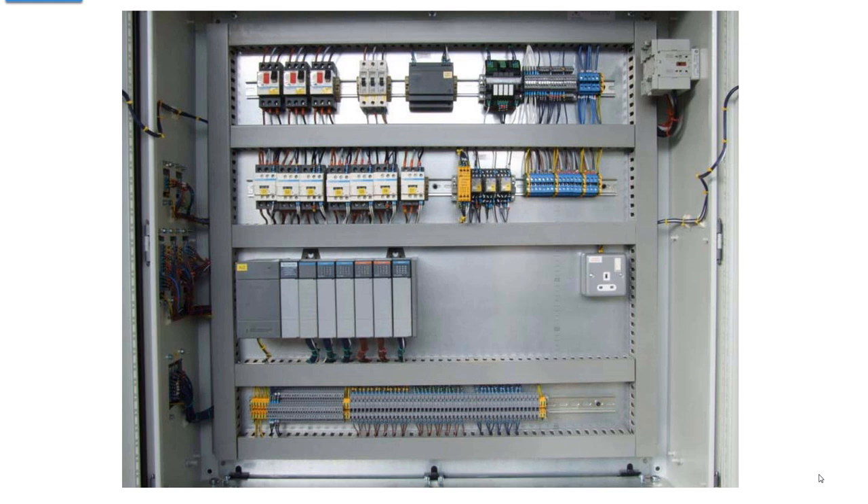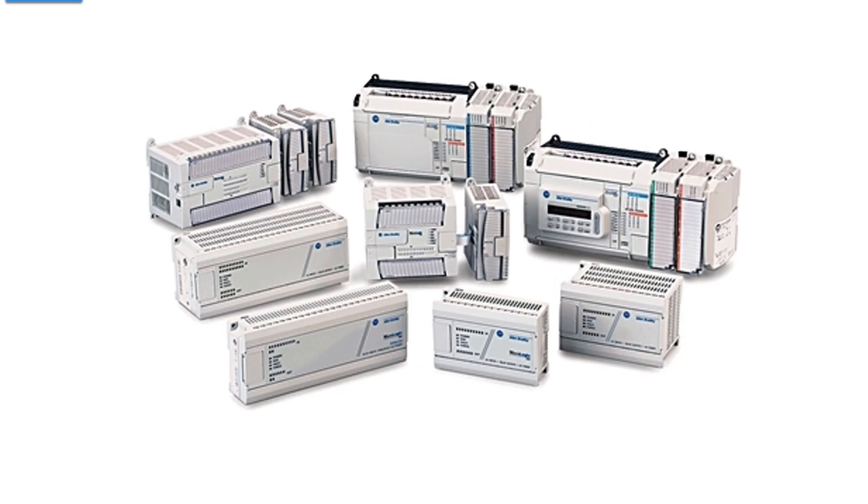Mount the PLC in a panel, connect it to the terminal strips, and this is what it looks like. This is a family of controllers — the MicroLogix family. All of these are controllers because they all have a processor and fixed I/O. All MicroLogix units are controllers, not processors. Several of them have I/O modules you can add on, connected by a ribbon cable, which serves as the backplane. Some upper-right models have connectors that slide from one module into the next, with a tab you roll over to push a connector into the processor. The last thing you need is an end cap for backplane termination.